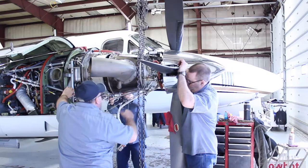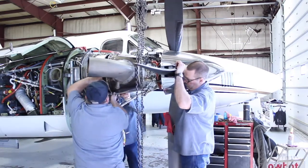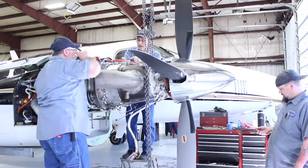The team puts the combustion liner in, then performs lock wire on the fuel nozzle while Paul puts it together. The experienced team finishes the day by putting the power section back on the engine.